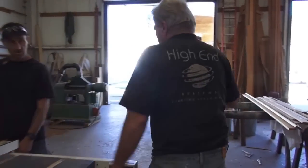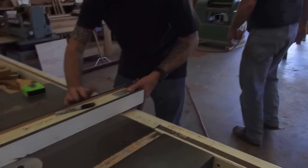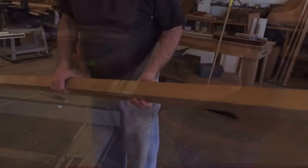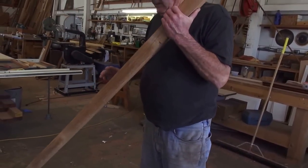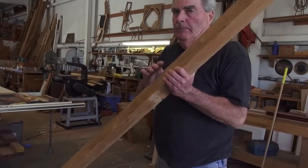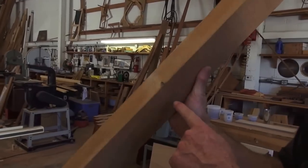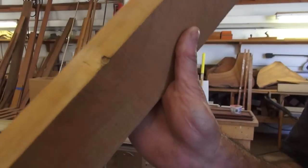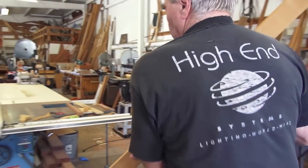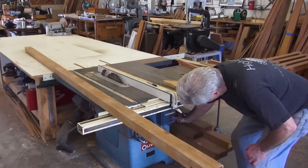Let's cut one — we'll just go crazy here. We'll cut that one with the knots in it to get rid of the knots. Set that about two and a quarter high — strong 13 sixteenths, just over three-quarter. These are all about three inches wide, two inches wide, and a little over two inches thick. The thick is going to be our new width. So we're going to cut the part out with the knot in it — see how the knot goes down into here? We know that's got to go, so we're going to cut it anyway, then see how it clears up.